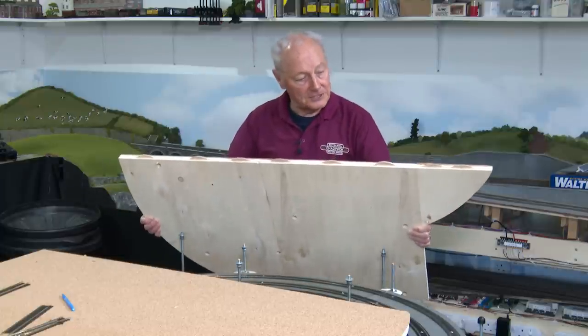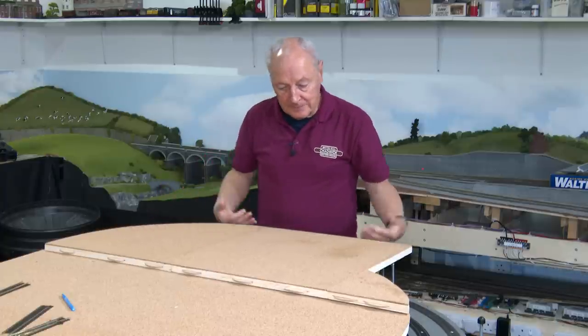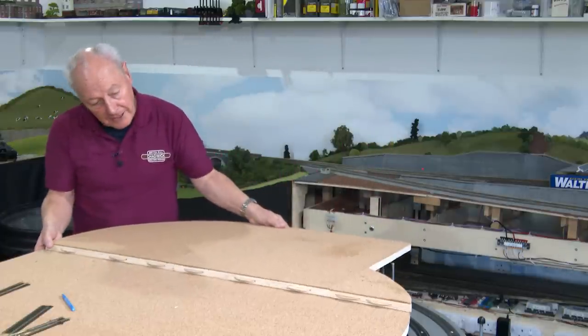You can pop the biscuits in, put the boards together, and you end up with very secure joints. Here you can see the biscuits along the edge — I may have gone a little bit over the top. To put this board in place I've used the M8 bar that comes up, then all I have to do is lift the other board up, align it, and it just sinks in. I'm not going to glue the joints because obviously if I want to get it apart I never will be able to, but it's held in nice and strong. It gives us another 20 inches of operating space to build our scenery at the end of the TMD. I'm not suggesting you go and buy one of these biscuit cutters, but if you've got a friend who owns one, give him a knock — and James, thank you for the loan of yours.